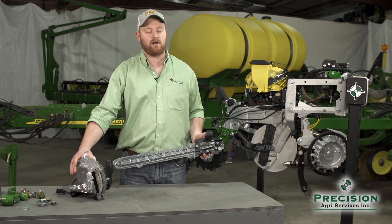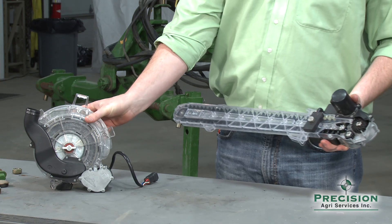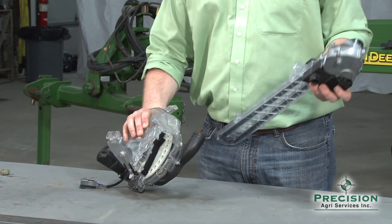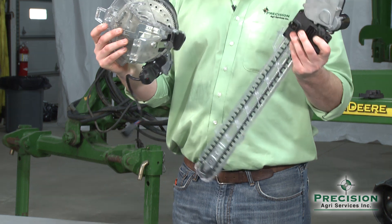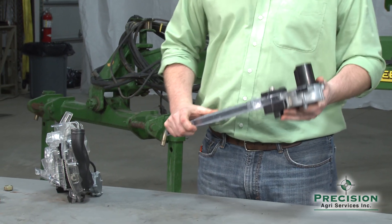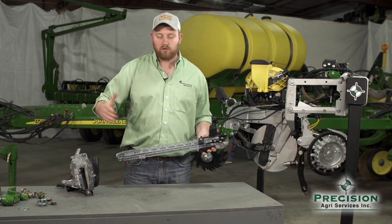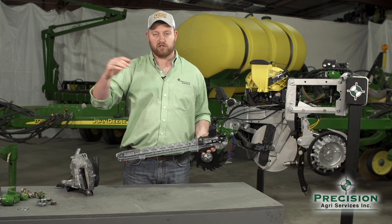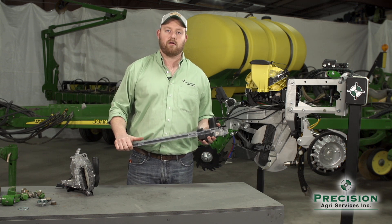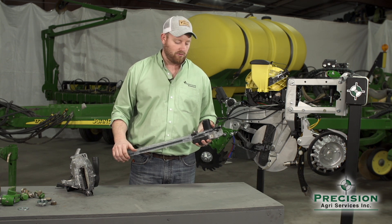This product is offered directly with our V-set tube meter from Precision Planting with our V-drive motors. They mount intertwined with each other so they fit together as one unit whenever they go on the planter. The components of the Speed Tube are very simplistic. When you want to go to a high-speed planter situation, the concern is seed placement and seed drop — we have to make sure we don't have seed deflections as it's going down the tube.